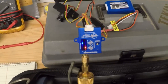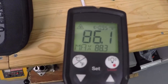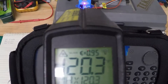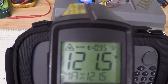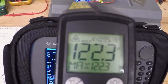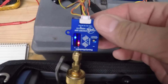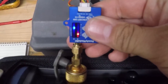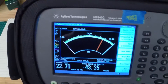Another thing to note: I've had this transmitter running for a little while and I'm going to shoot the temp — it is quite warm. Right now we have an ambient temp of about 86 degrees Fahrenheit, and that transmitter on the bench is about 121 degrees. When it's flying you have airflow around it so it should be a lot cooler, but it is definitely warm to the touch just sitting here. It may not be a bad idea to mount it on a small heat sink — that might help it live a little longer. Some of that heat is probably getting dissipated into the analyzer as well.